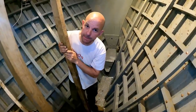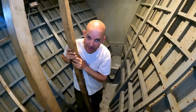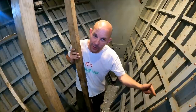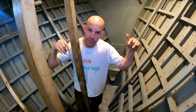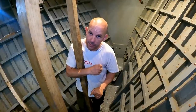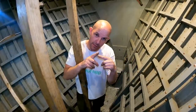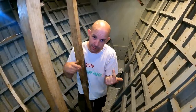While the paint dries I'm going to make a brew. We've been having a big debate about the water coming in. We've just removed these bolts - if we knock them all the way out, water will come in. So we're going to screw these frames to the keelsons, mark out where it's going to be screwed to on the web frames, then wait for the water to go away. Then we need to come back from outside to put a drill mark on the floor, take that to the pillar drill, and properly drill them.